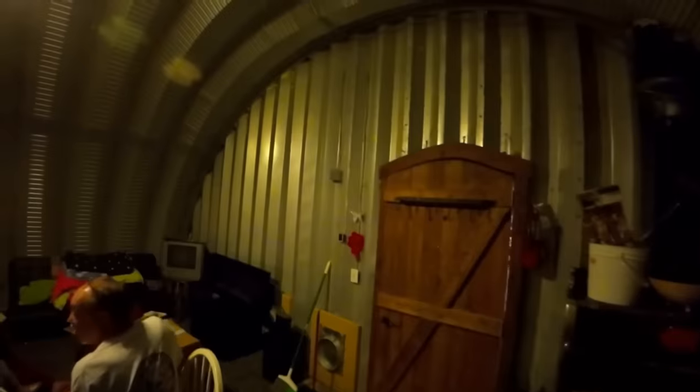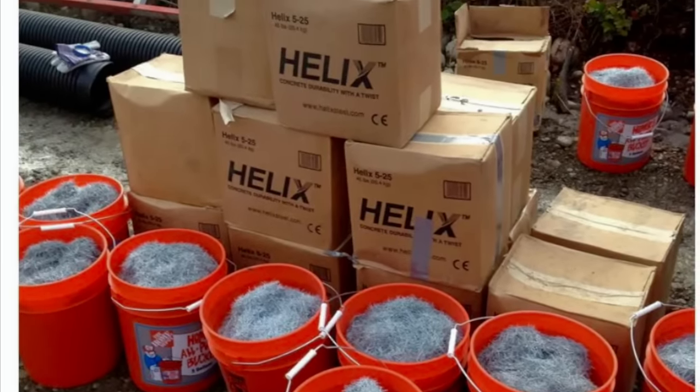The insulation is spray foam in conjunction with the helix steel concrete shotcrete on the outside. I'll drop in a picture of the helix steel here. This is the vent for the wood stove — those vents don't leak because they're spray-foamed in place with about six inches of closed-cell foam around them, which is impenetrable and helps with any sweating around that area. The whole structure is about 24 by 40, so roughly 800 to 900 square feet — call it a thousand. The tunnel is 10 by 40, which is another 400 square feet, giving you over 1,200 usable square feet. You can go any length you want on this.